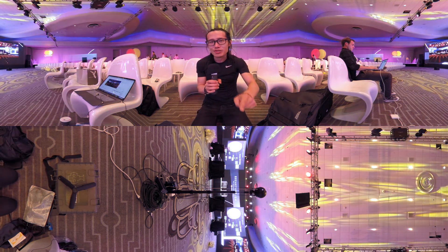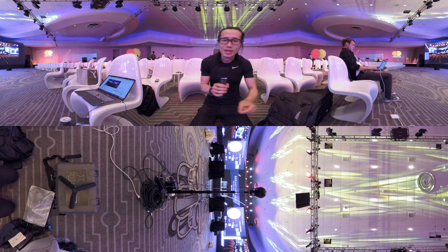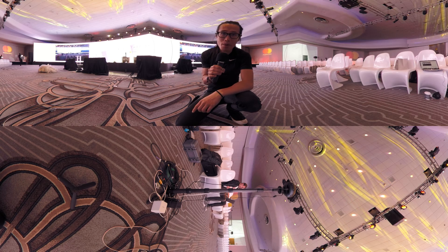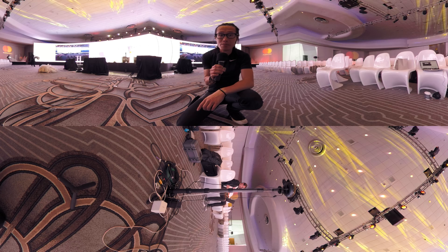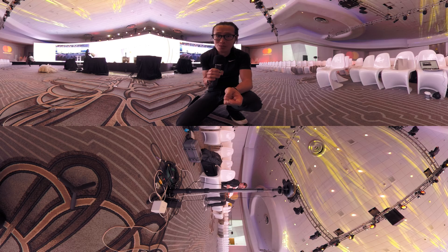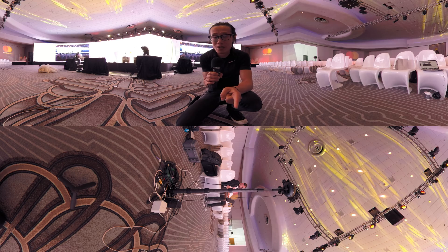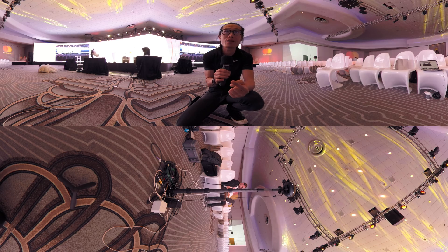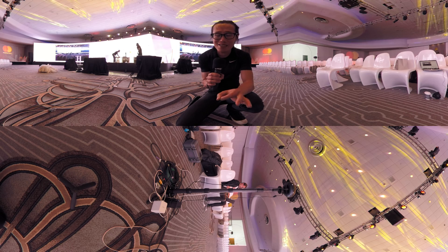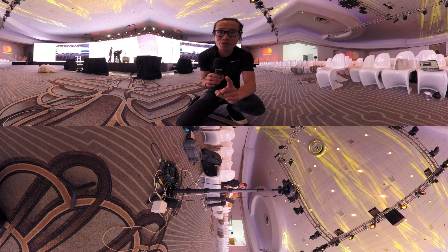There is a mixer there but we are actually not using the mixer for audio. You can see the bottom part of the Insta360 Pro doing a live stream right now. I connected an H4n — a really old Zoom recorder — and it actually worked great, better than the audio mixer. I'm using the Zoom USB connected directly into the camera so we have super crystal clear audio. The audio input level is 0.3, really low, so there's no noise.